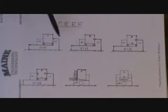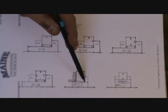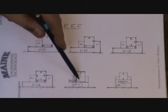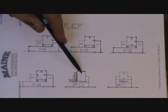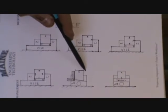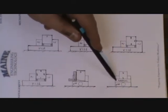Clean and deburr, then put the first machined face against the parallels and machine opposite face four — now parallel with one and square with edges two and three. For the ends: stand the part up on end, use a machinist's square against the bottom of the vise and the side of the part, hold against the part and tighten the vise simultaneously so the sides are at a right angle to the vise bottom. Machine end five, then deburr, flip, and machine end six. If you don't follow FEEF, you'll end up with a part that's not square — it'll just look like it did before with cleaner faces.